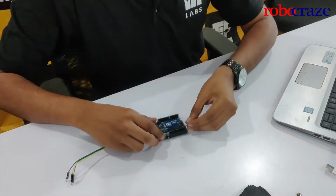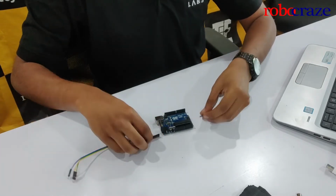This is called the pulse sensor and it has three basic functionalities. One, it has a light emitting diode, LED. Two, it has a photodiode. And three, it has circuitry for noise cancellation and the amplification process. So on the PCB side, there are three leads: one for the signal, analog signal in, the ground, and VCC. The setup is very simple.